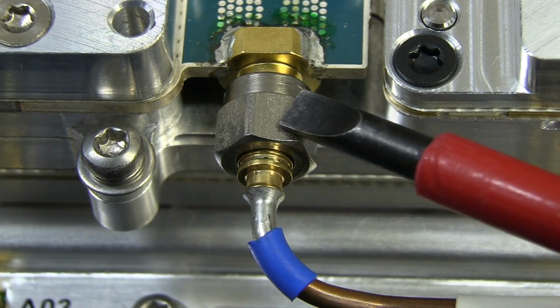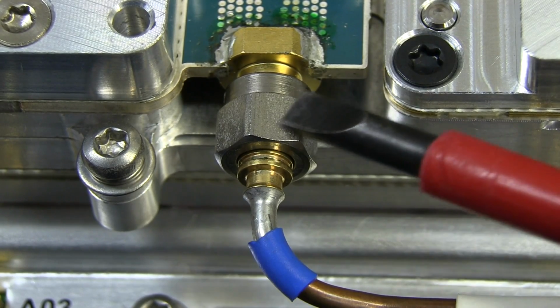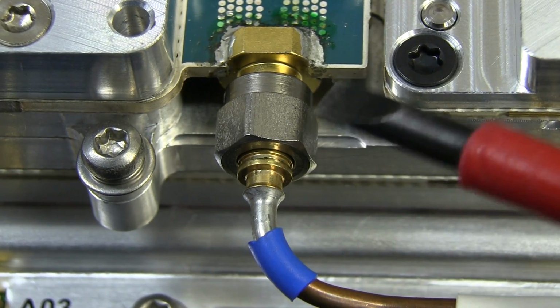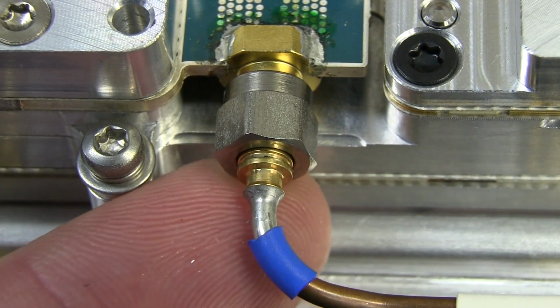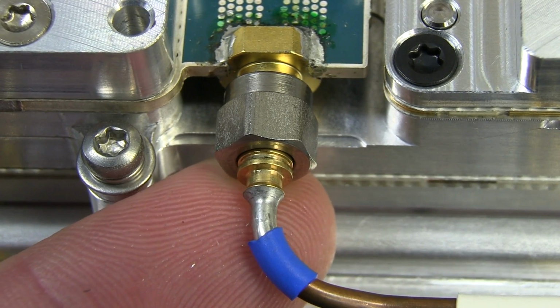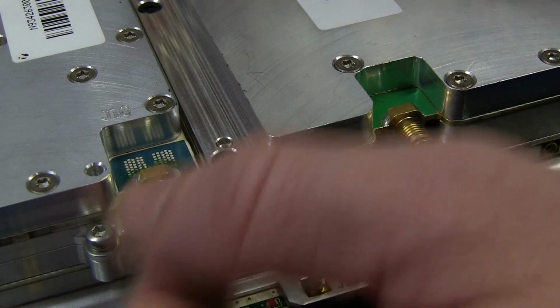And by doing that, I'm probably voiding the calibration on this thing, of course, because when you're talking about a 20 gigahertz bandwidth connector like this, even the torque on the thing matters. Really, or it very likely could. So the odds are that I'm not going to damage anything by taking it off, but the thing actually might need a recal after this, certainly. And off we come.